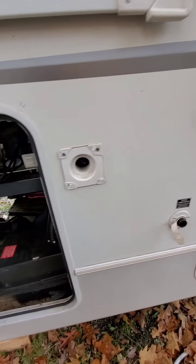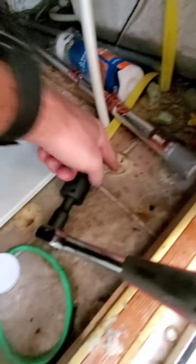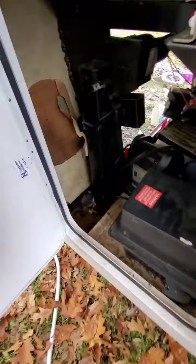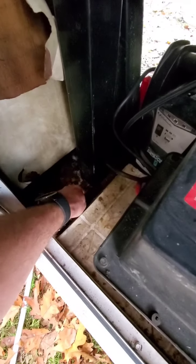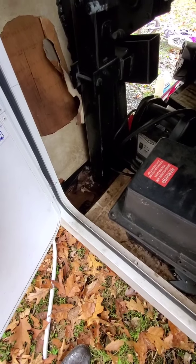You can use one trick for areas in your camper where there might be a hole, for example, like here where there used to be a pipe coming through. You can put steel wool, which is great for any type of mouse or rodents. They won't get up through these spaces if you put steel wool there. They seem to dig right through insulation and use it as their home. Steel wool they don't seem to like to press their nose to.